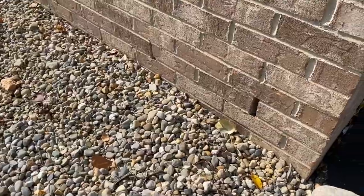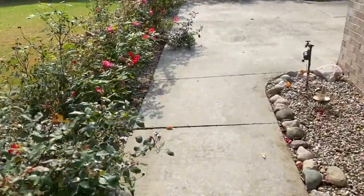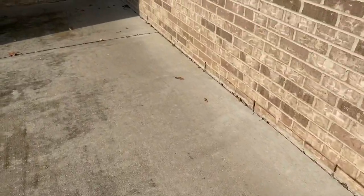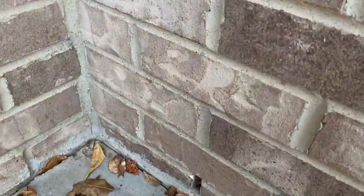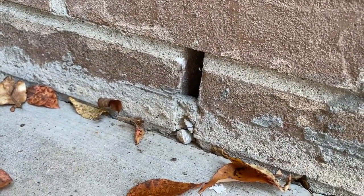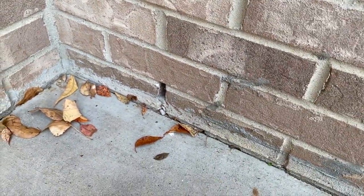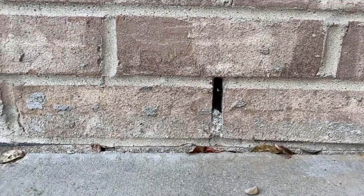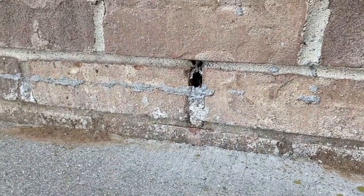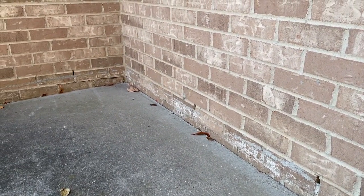There are additional weep holes — as you can see, that's kind of a big one. On this portion of our house, where the concrete basically meets up with the brick exterior wall, the way that the Masons did these — it is half mortared, or about an inch of mortar up from the concrete. That is on purpose, by design by the Masons. As you can see, half of it is mortared in, and that is by design. So we will have to make cuts to the weep hole screens or covers in this section, and that's not a big deal — we will show you that.